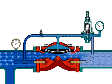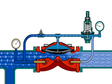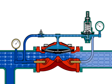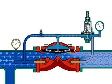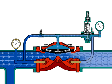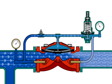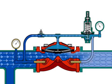Should the downstream pressure drop below the set pressure, the pilot valve will reopen to once again reduce pressure in the diaphragm chamber. The regulated flow through the pilot valve decreases or increases the pressure in the diaphragm chamber to sufficiently open or close the PRV-1 as required to regulate the downstream set pressure.